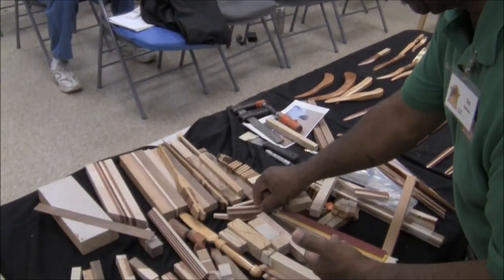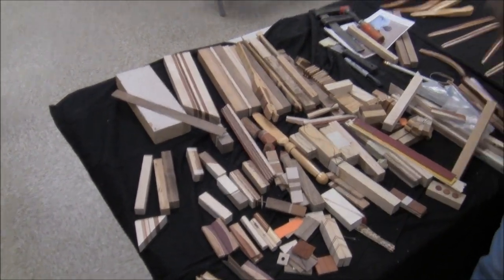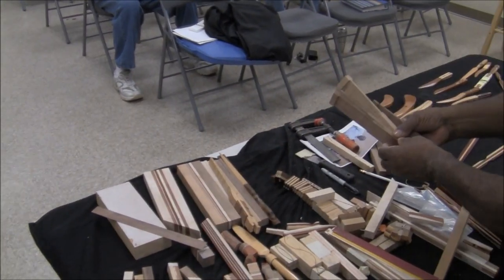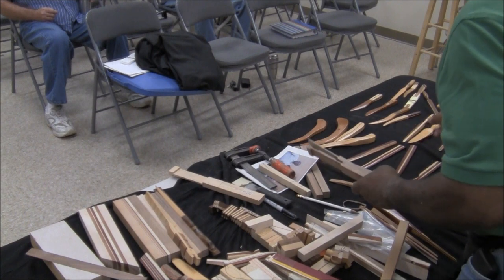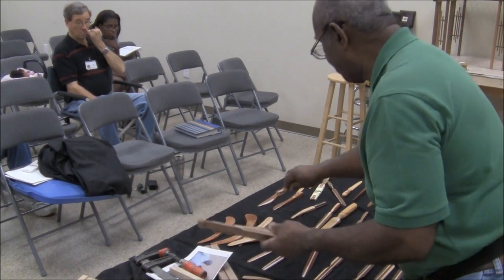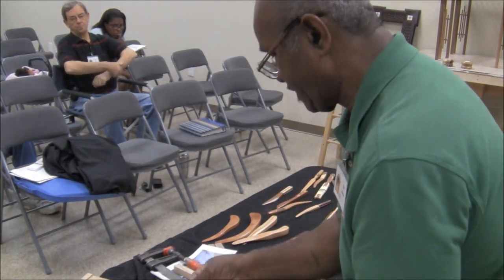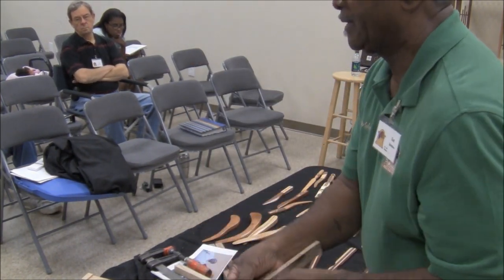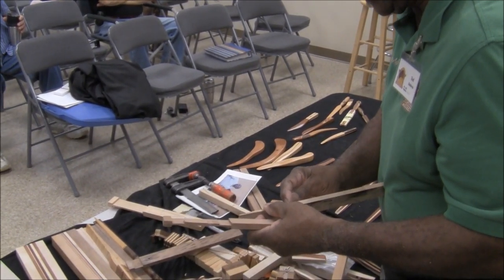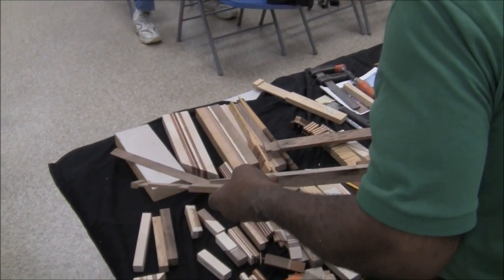And like I say, what I do sometimes. Does anybody want to see how I put the inlay in? Oh, let me tell you this right quick, I won't hold you up. When I get ready to do these, where I'm gluing the handle on each side, I need to be able to get to this point where I'm gluing the handles on. And the reason I need this to be square, when you make a transition coming down, if it's not recessed in there, you're going to get a raggedy look on the edges that will not be pleasing.